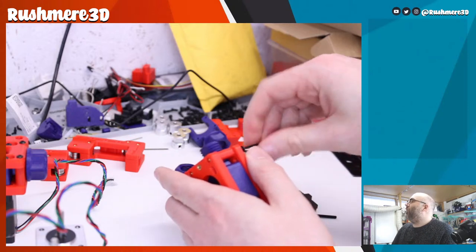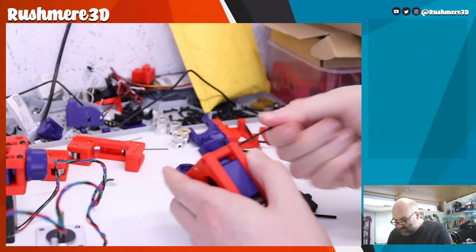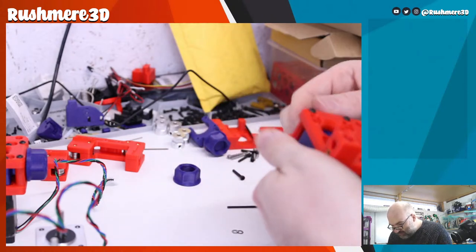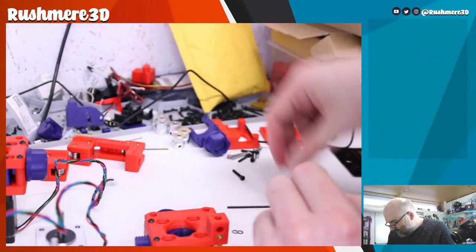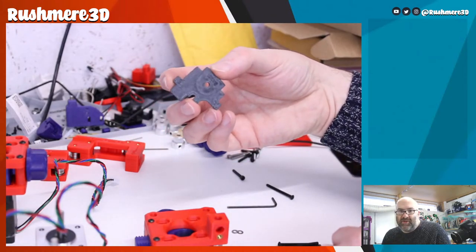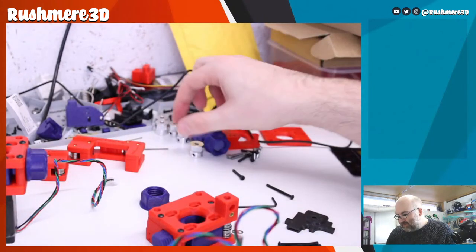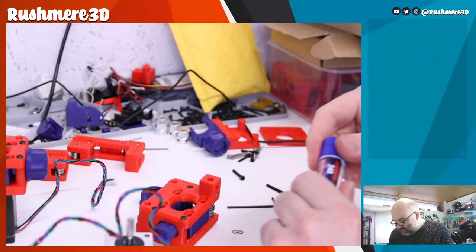Next step will be to put it fully to our stepper. Yeah, so this is going in a lot better. Cool. Okay. Won't do that too tight just now. So I've got one of the parts, a little spacer gap part, from the previous V0 build. Take one of these 20 tooth pulleys, and we'll put some Loctite on the grub screws.